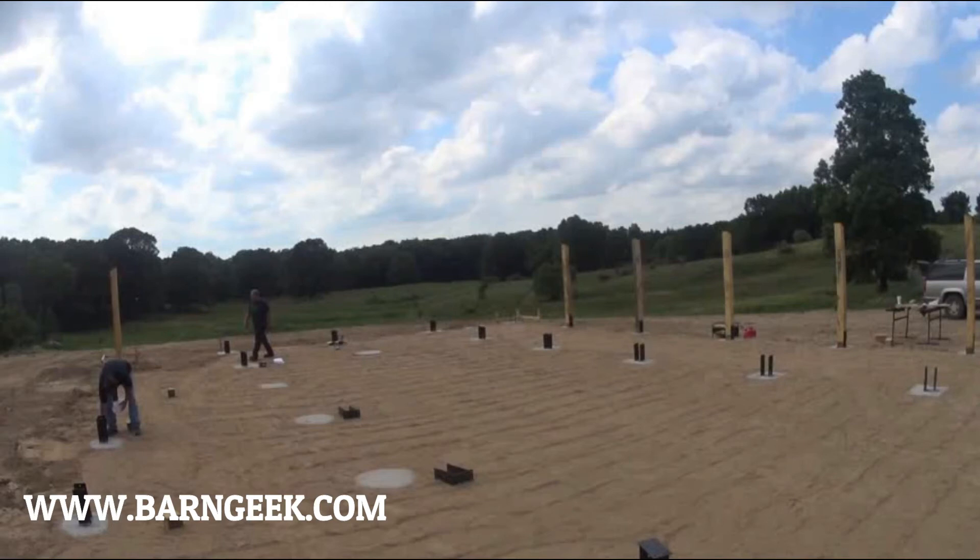This video is going to cover how to set up and lay out your U brackets and posts to get started with your project. This is a very important step. It's important to get this right — get all the measurements right. Make sure all these U brackets are lined up with each other, because if they're not, it'll throw your whole project off. Lining these U brackets up correctly is critical. We took several hours to do this and make sure we got it right. It's important to check and recheck your strings and make sure everything is parallel.